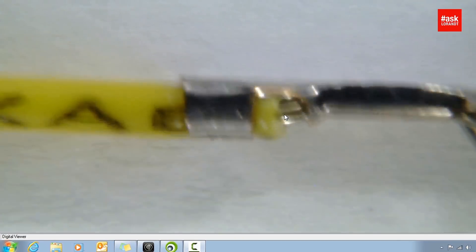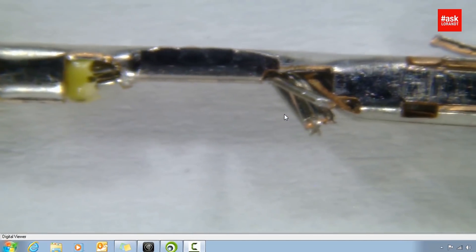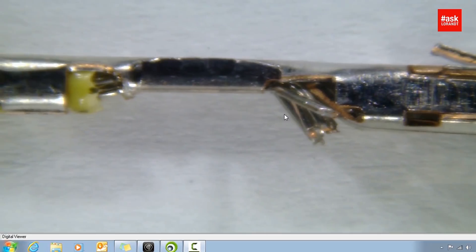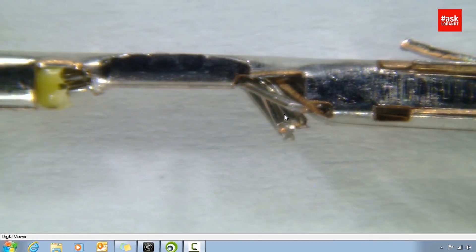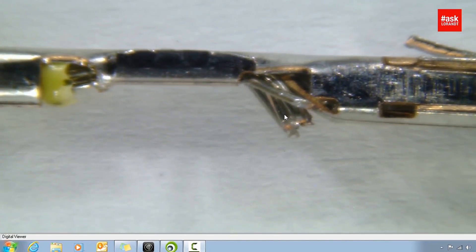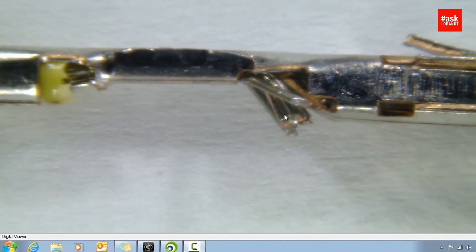Not so far away. Then we have here this nice angle for the contacts — the contacts are very well crimped. But what I can see, like I saw already before, my wire is a little bit too long and it looks out of this area. So actually the wires are going too deep inside, so I have to shorten them. Let's not look so good.